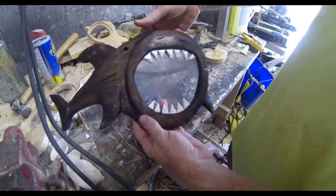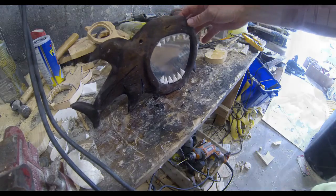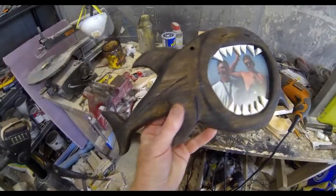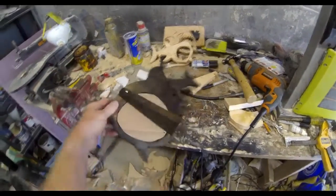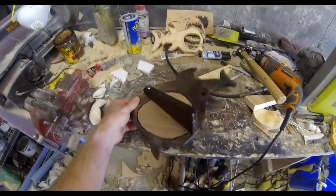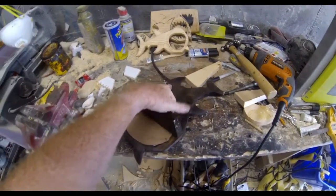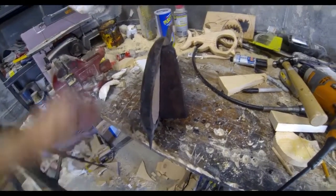The only other thing is to make a stand so the frame can stand on a shelf by itself. Here's the plexiglass in position. I'm going to make a simple stand to hold it at the right angle — just another piece of pine screwed onto the back with one screw at the top. It pivots on that screw so you can open it out of the way to change or insert a picture, then pivot it back into position to act as the stand.